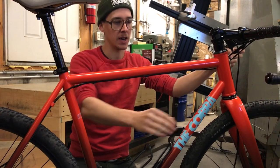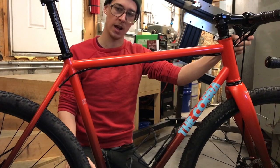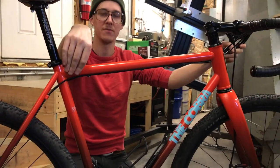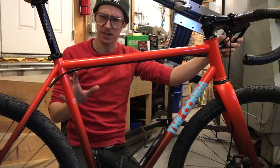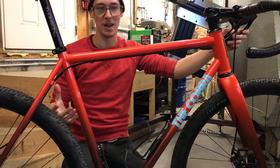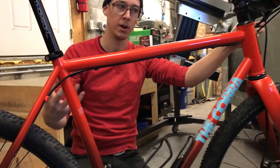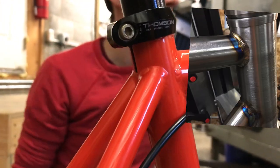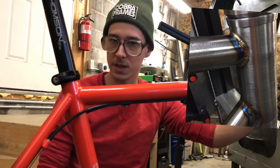The main tubes on this bike were True Temper — stuff I had around. These are thinner-wall tubes than what I usually weld into a frame. I think they're 747, so the butts are 7 tenths of a millimeter thick and 4 tenths of a millimeter thick in the middle of the tube — both the top tube and down tube. The frame is kind of springy; that's my finding with these. Welding them is trickier to get a good weld without burning through, but it came out pretty good. I used heat sinks and it came out nicely — I was really quite happy with that.